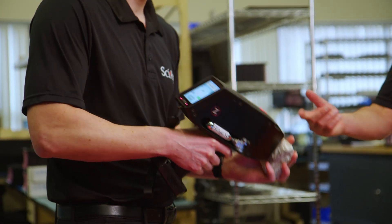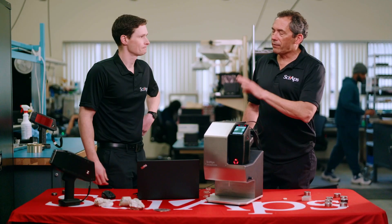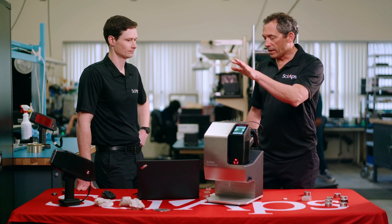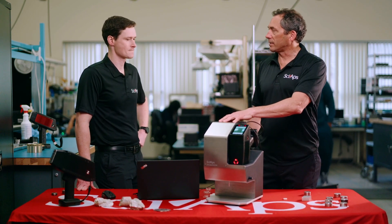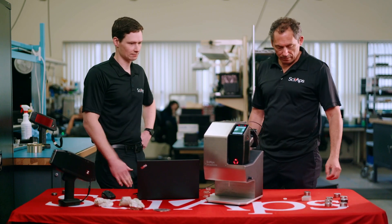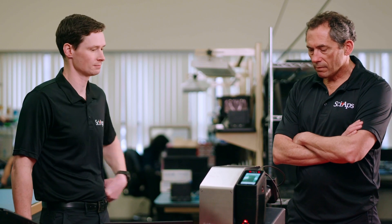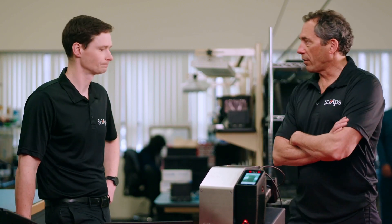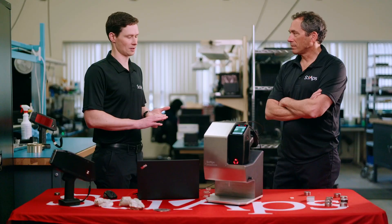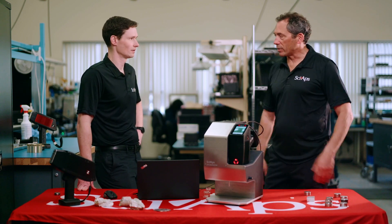Let me do a quick rock sample — just like that, we've got a breakdown of the elements in a rock. So if somebody has one of those existing Z903s, they can purchase the brines accessory, bring it in, upgrade it, get the new plate, retrofit it, and off they go. We would replace the nose piece that allows it to dock in, calibrate up for brines, and include this box. One question we get is: can I use the Z901LI with this? The answer is no — this box has been designed for the larger Z903. If you want to measure boron, sodium, and these other elements, you need the wider spectrometer range.